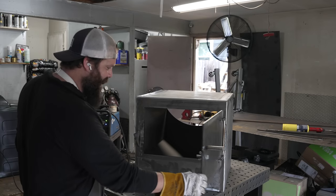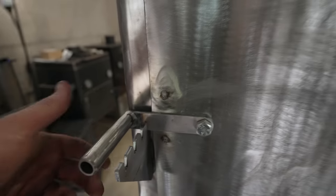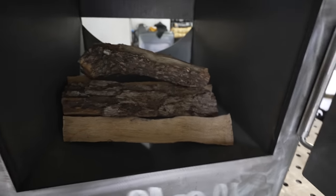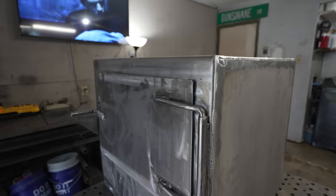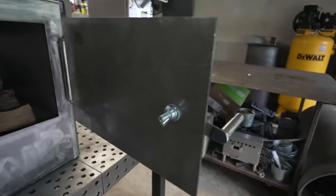Firebox is finally done. There are certainly more simple designs you could go with, but I like the way this one looks — nice heavy-duty hinges, fully welded, those aren't going anywhere. We've got the classic patented Chud notch system with a little bead so this thing doesn't go flying in either direction. There's the whole V system in action — nice bed of charcoal, real clean burning fire, big firebox that fits a whole bunch of logs. Nice smooth clean welds all the way around. Got the exchange on the back, which is lower than I'd typically do for a regular offset since this is a reverse flow. Got the nice quarter-inch overlay door — much simpler than the whole picture-frame design I used to do. Classic bolt, wing nut, and a couple of washers — I'll probably get a smaller bolt eventually.